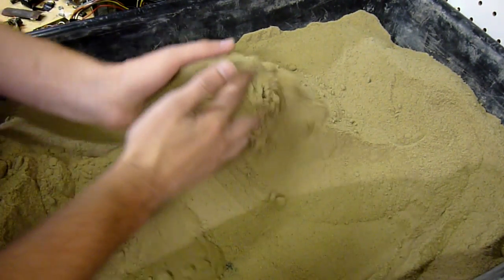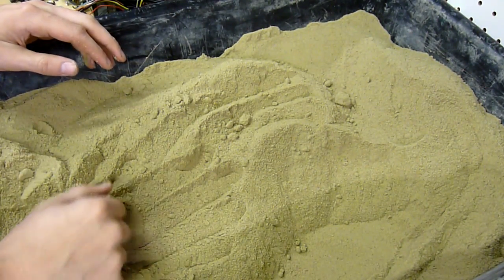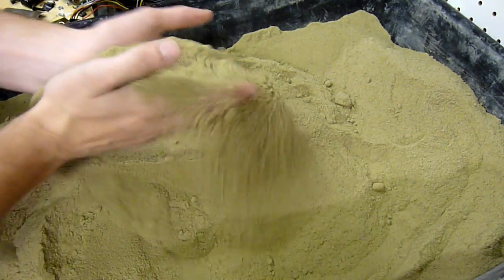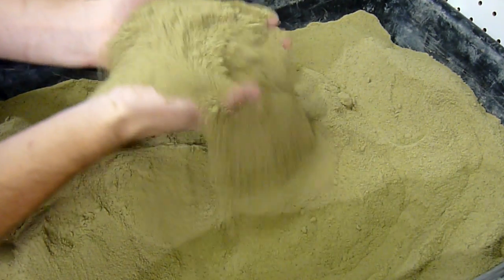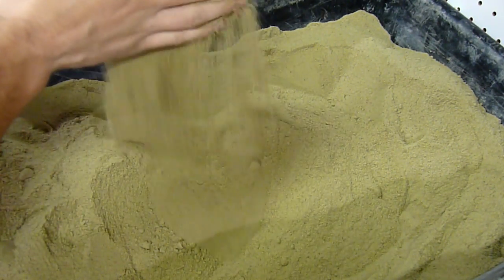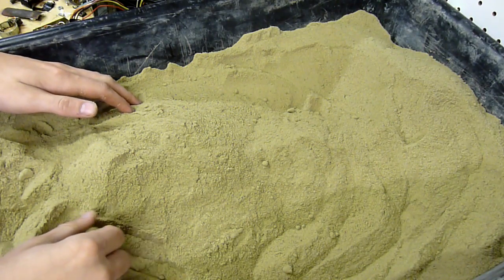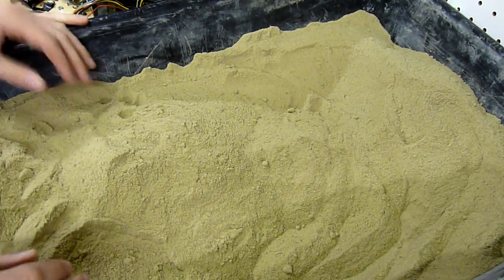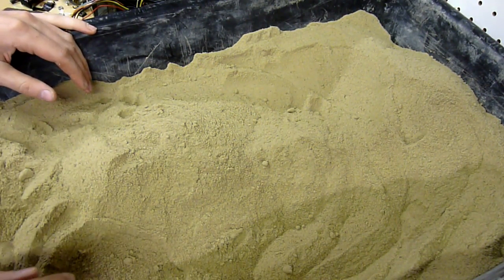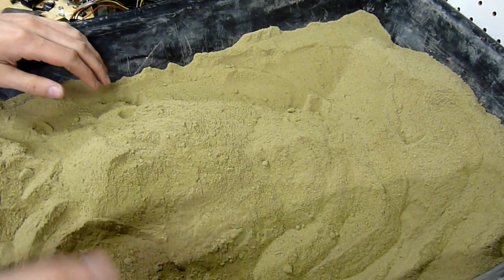You just have to play with the water content, and I found the water content is super critical, especially for beginners, because when I first started I would always make my sand way too wet, and that was a huge problem. If you see here, the sand looks like it's dry — it's just barely moist, there's almost no water in it, and this is the consistency you want. I was making my clay like beach sand where you can make sand castles, but my molds kept failing. The parting line would never open up right, and I'll show you what that's all about in the next video.